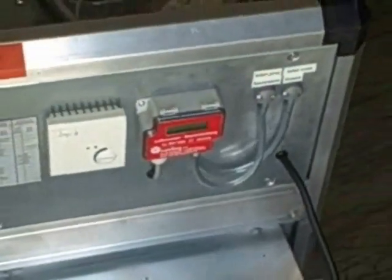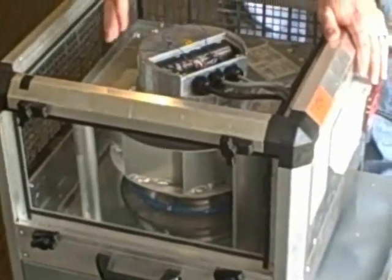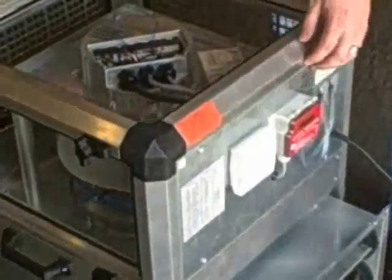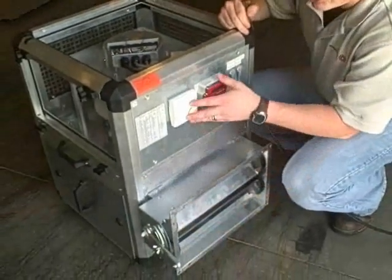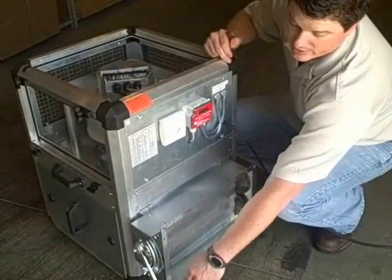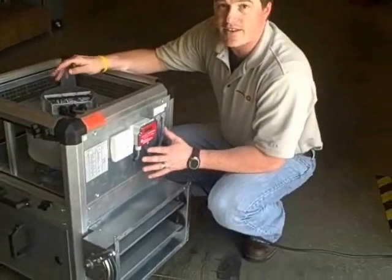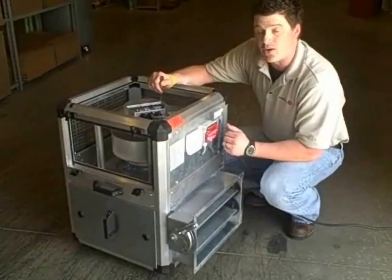We'll power this back up. After the click it'll run through its internal checks and slowly ramp up to speed, running at about 50%. We don't want to run it any faster. In this case the customer can set damper controls here. The fan will run at a set RPM regardless of whether the damper is opened fully or closed — the fan will not change speed. Once done, we'll shut the stack down, wire in our RS-485 to USB connector, hook it up to our laptop, and go over how to run and monitor this thing in detail.